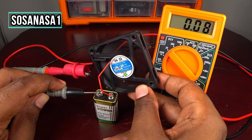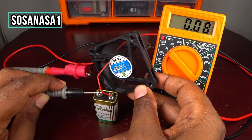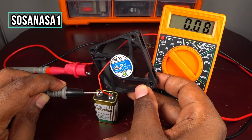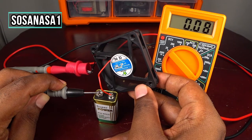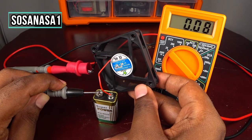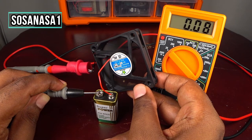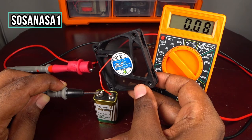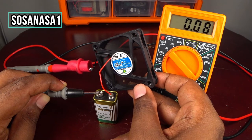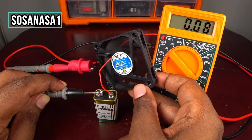In this case, this is more or less 90 milliamps. This is good because this number is below the number written on the electric fan — meaning the actual milliamps or amperes used by this fan are within spec. In this way you can measure how much current a small electric fan uses with a battery and a digital multimeter.